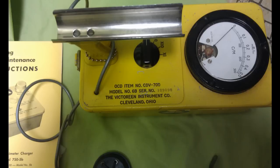If you look at this next picture, it's a very close-up zoomed view of the Geiger counter — the CDV-700 model 6B, one of the latest ones at the time and supposedly a pretty decent one. If you look at the gauge, at the top it says MR per hour, and under that it says C/M, or counts per minute. Generally speaking, around 100 to 125 counts per minute is cause for concern — governments don't want to see those numbers. You'll see readings of 28, 30, 40, 50 on radiation maps, and that's fine. Once it gets to around 100–125, it becomes a little bit of a concern — not deadly, but crops and animals exposed probably shouldn't be eaten.